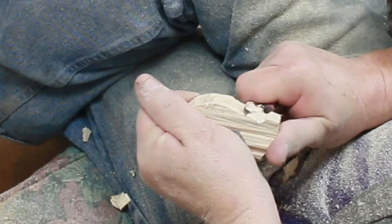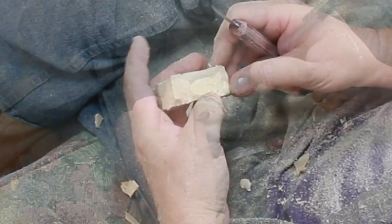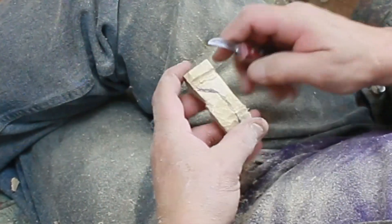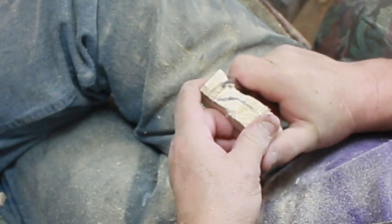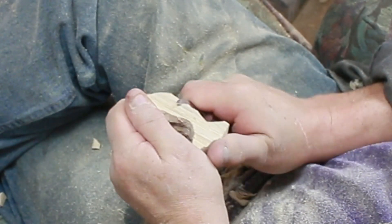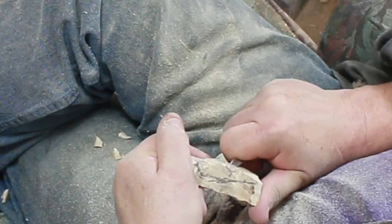I got the new sharpening equipment in, or my old standard which are diamond stones or slips — kind of interesting shapes. You can do chisels on them, all kinds of stuff, because they're concave and go all different directions. Always marking out your reference lines. This body I kind of wanted him to twist around. If you watch a hummingbird at a feeder, they never fly straight. If you're a beginner at carving, the hardest thing is to get some life into your carving — you can get life into it by changing the pose, giving it a little motion: a head tilted to the side, one wing not symmetrical with the other, the body turned off to the side.